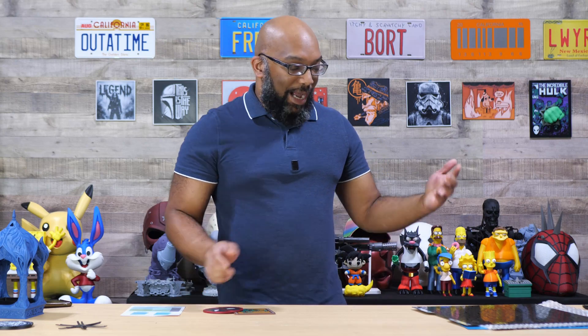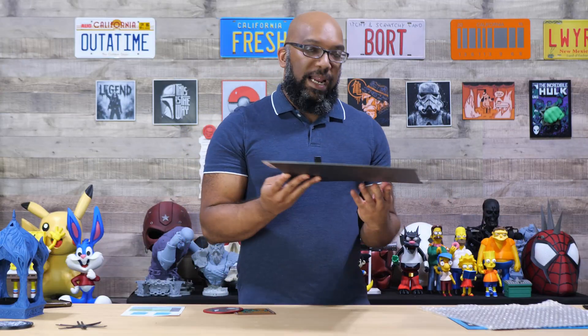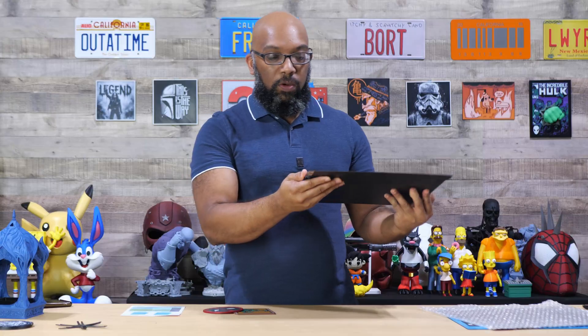I've got a love-hate relationship with plates like this. It's not just this one — I have another plate that does the same thing on other printers. Adhesion is just not my friend with these. Overall, I think the greatest plates BQ makes are definitely the CryoGrip plates. For me it's the Frostbite, because I mostly just print PLA and PETG, and it does a wonderful job at keeping the temperature nice and low while providing a really solid grip on prints.